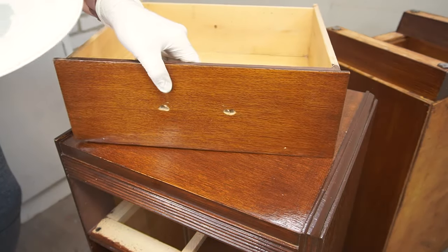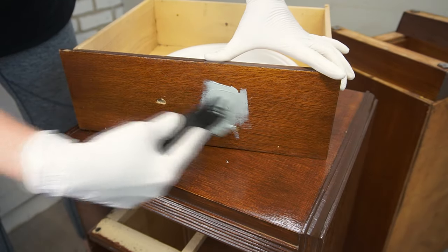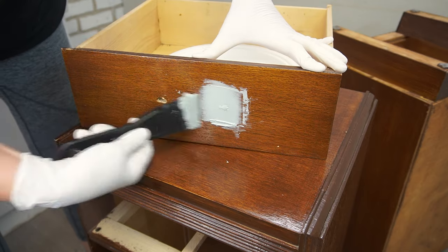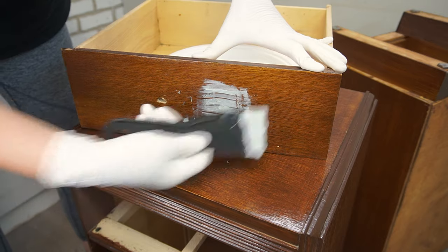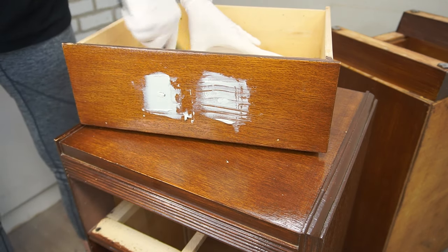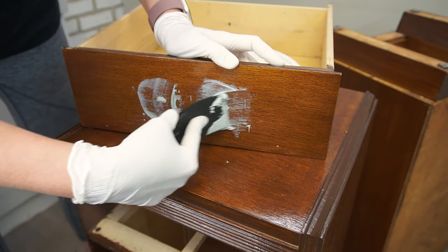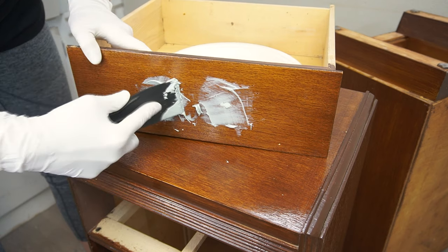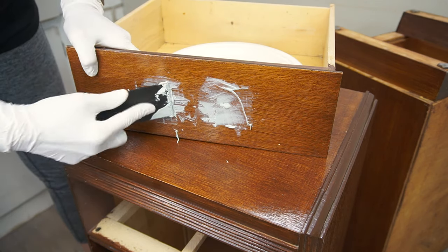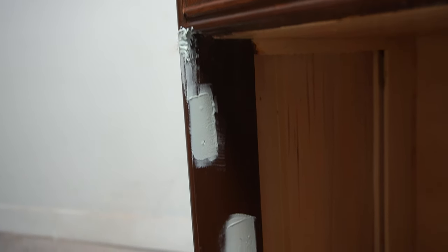Another Bondo tip: as you can see, there are two holes drilled into these nightstand drawers because the original hole wasn't filled and different hardware was used to cover it up. I wanted something strong enough that if I decided to put another handle on, it would hold — and Bondo is just that. You can drill through it. It's not soft, it is tough as nails, and it will hold a screw in there just fine if need be. Whenever you have larger holes to fill, Bondo is a fantastic tool for that. It dries super hard, super tough, and it is drillable. I worked my way around the piece filling in all the smaller holes as well.